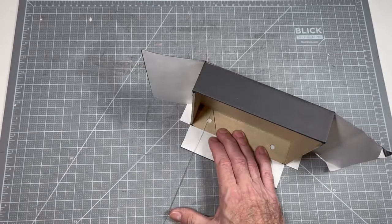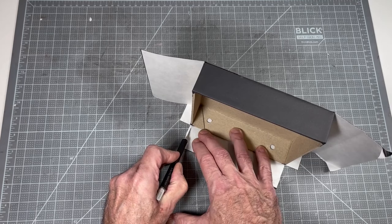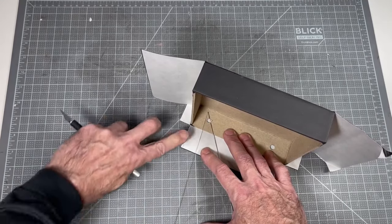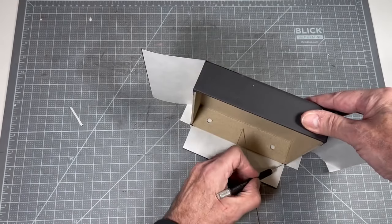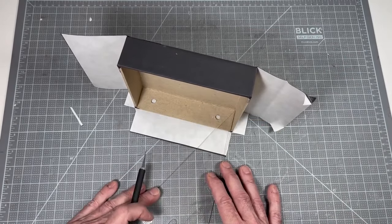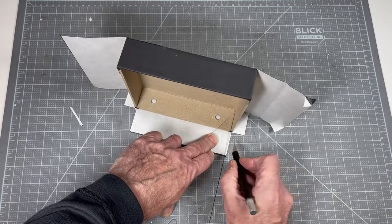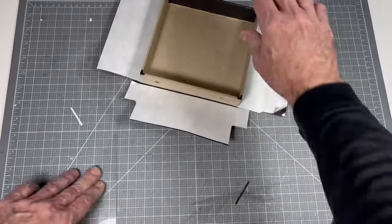This piece of material is going to wrap up inside here. I need to remove some material so it'll fit inside — roughly the thickness of the board. When it travels across the top of the board, I need a 45-degree little notch right there. I'm doing this by eye, cutting that little 45 — that's very critical. Then I need to eliminate the excess material: lining up with the inside edge and that little 45, reducing the material so it goes across the top and then inside nicely. I need to do that on both sides.